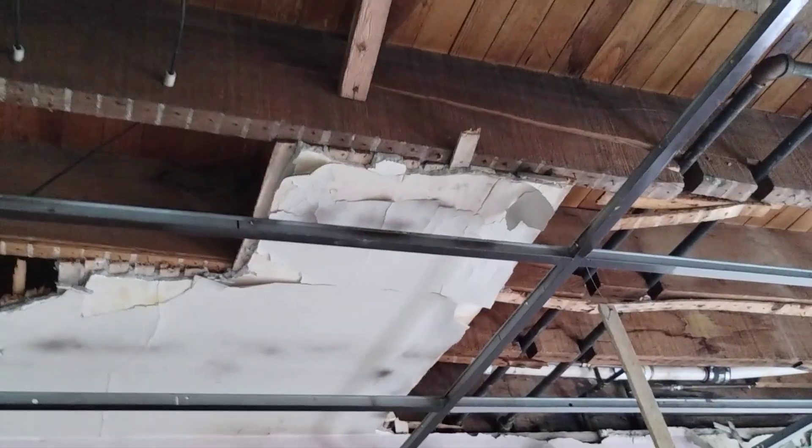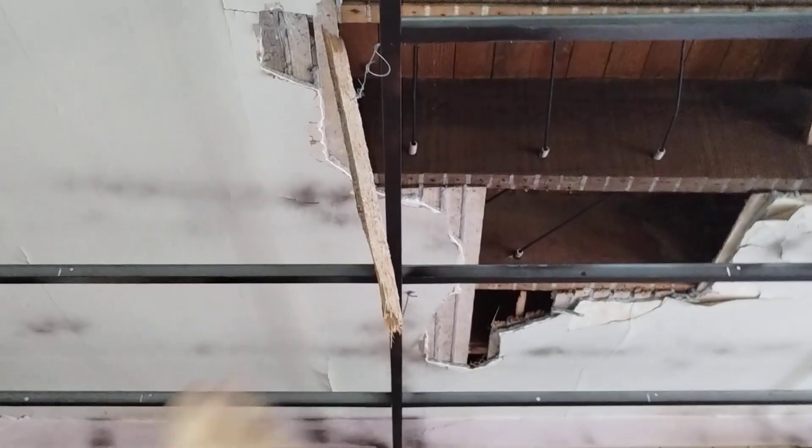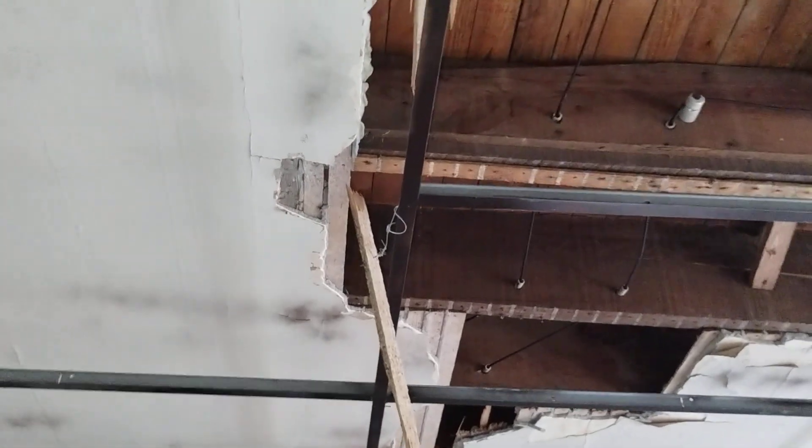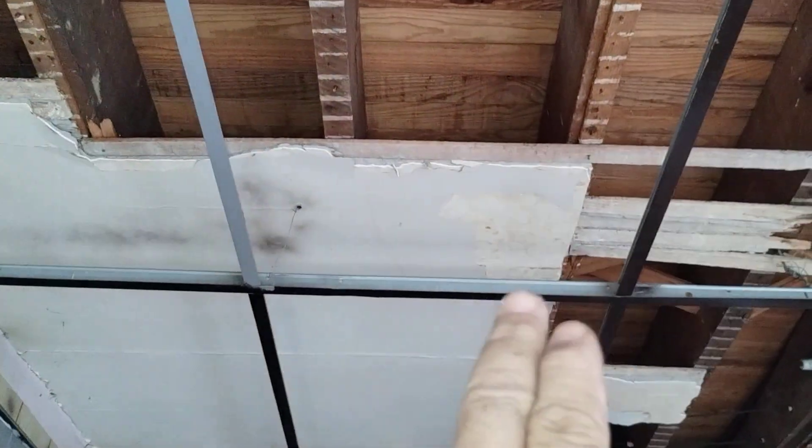Check for deflection right now. Let's have him walk up there. There's a wall right about here for the hallway, so right about here is a transfer of load from the ceiling of the roof above, down to this floor, and then loads back to there. All because of the knots. The rest of it looks pretty good so far. I might have to give you another video to talk about spans. If I see any fractures there I'm going to have him take a peek - an inspection hole out here. Or the guy had some old photographs of that ceiling up there I'll need to see.